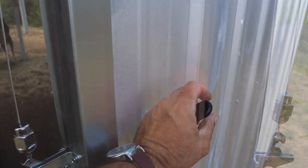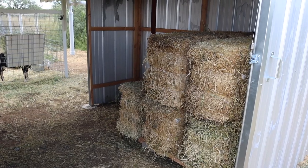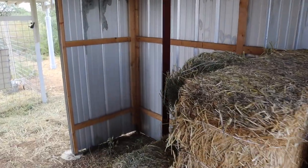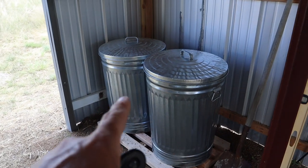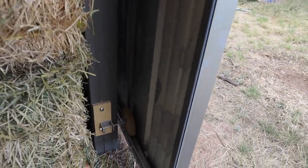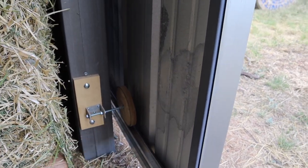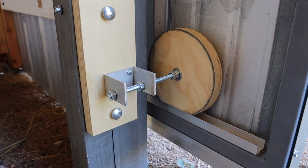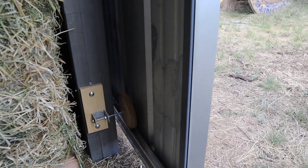On the other side of the door I have a golf ball threaded in so I can operate the lock from inside. I've already got some hay stored in here, blocked up off the ground so none of the hay is actually touching the ground. On the other side I have two galvanized trash cans full of beets and calf manna as supplemental nutrition for the goats in addition to the hay. The last little thing I'll show you is my little DIY barn door track hardware — I put a piece of aluminum channel right here, and I used one of my old circular cutouts from my workbench build with a bolt and some nuts to make a trimmable door guide so I can move it in or out to keep the door exactly parallel with the barn structure.